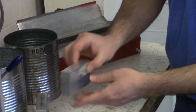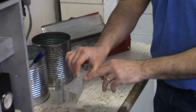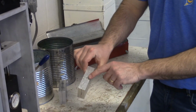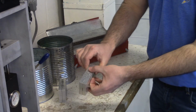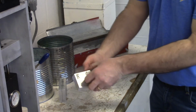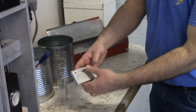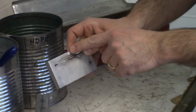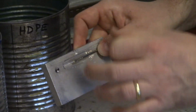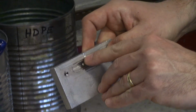All right? My next job is to slide this underneath the injection molder nozzle so that plastic can enter into that opening. We call that opening the sprue, where the plastic enters the mold cavity. Let me open this up again. In a single cavity mold, such as this screwdriver handle, the sprue goes right to a narrowed, a little smaller opening that we call the gate.